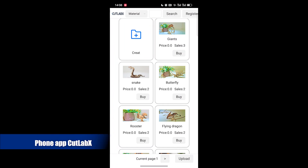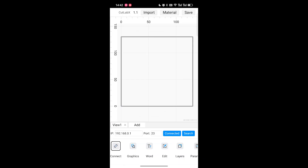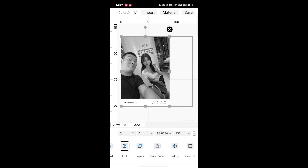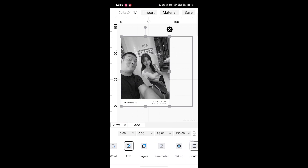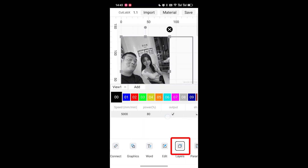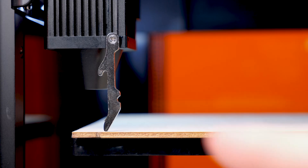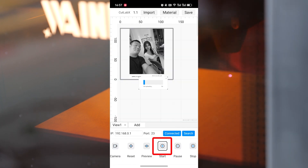Here is the interface — once you are connected, click on Create to access the main interface. Here you can use two fingers to zoom in and out of the engraving area. You can import the pictures you want to engrave and adjust their size by inputting values or adjusting the frame. Keep in mind that the maximum engraving size is 130mm by 130mm. Down at the bottom, we have a taskbar with various functions that are quite self-explanatory. To adjust the speed and power, simply navigate to the Layers section. For laser focusing, place your material on the plate and lower the focusing rod until it touches the material's surface, then retract the rod and you're all set. Back in the phone app, press Preview to get a preview of the engraving, then press Start to initiate the process.